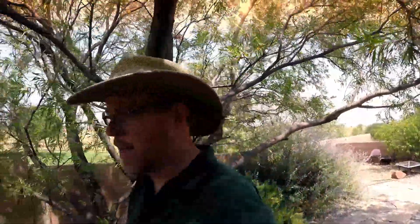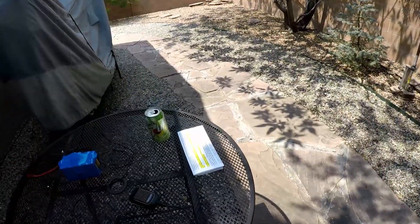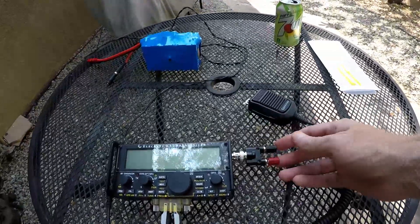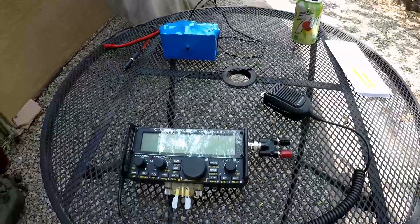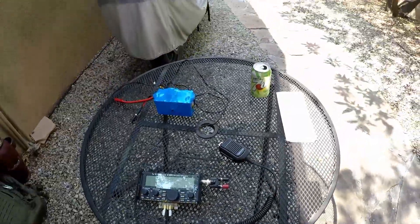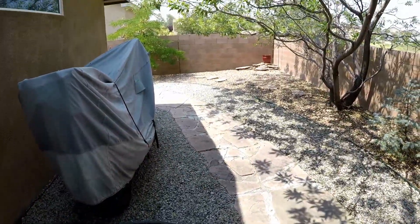Anyhow, join me, Greg Tech Gear Junkie. Let me test out this coat hanger antenna and see how it does. I've got the KX2 here ready to go. Now, it requires a balanced feeder. Because my KX2 has a built-in tuner, I can just connect it right here to my balanced connection. If you're just trying to feed it with coax, you'd need a 4-to-1 balun. I don't have one of those currently. Inside the house I've got a heavy-duty tuner with balanced input, so we can hook that up too.